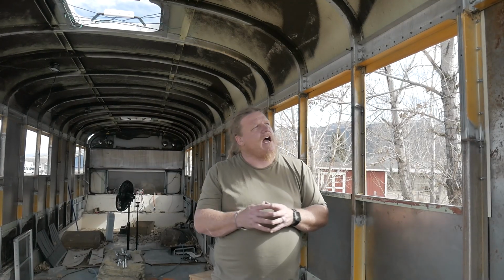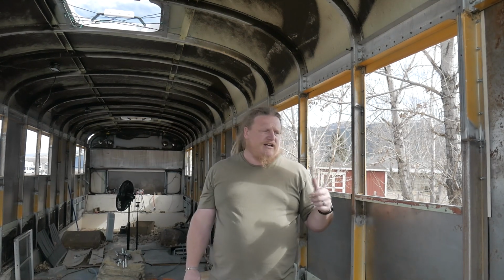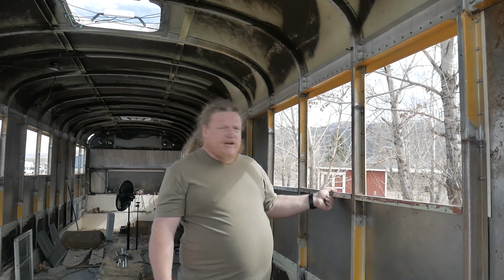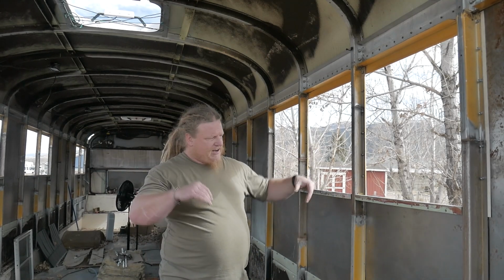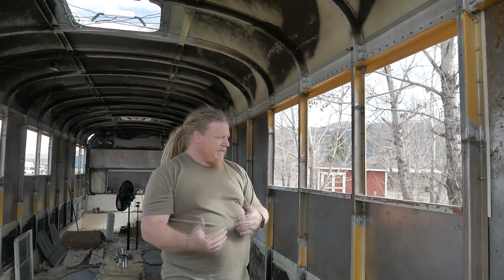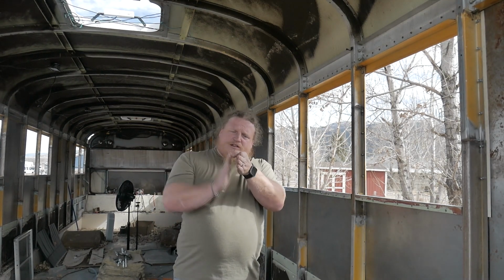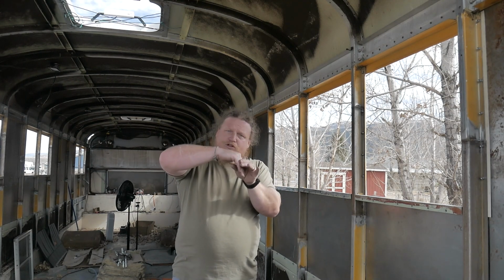Coming along. Off camera, between my wife and I, taking turns, we got the rest of the pieces all mounted on this driver's side. So we're ready for rub rails. These pieces, window sills, are not physically attached. They are resting and they have pieces that are overlapping them. They will get riveted with the rub rail. So the window sill overlaps the new metal and then the rub rail goes on the outside of that. Those three pieces get sandwiched together with rivets.